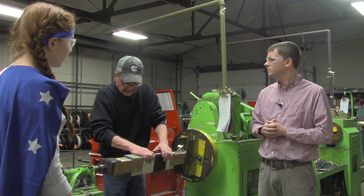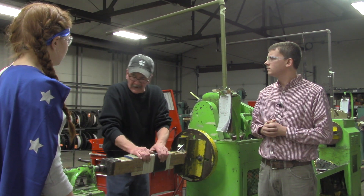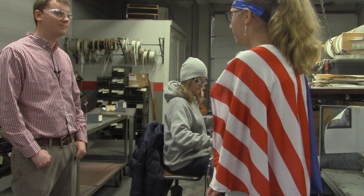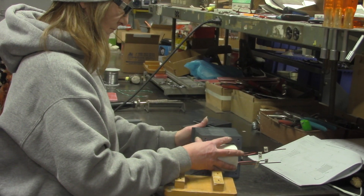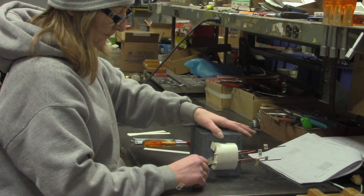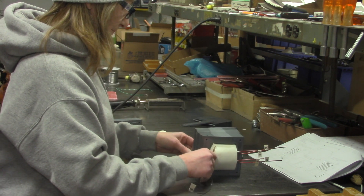I have an amount of turns, and I'll insulate that to go to a primary wire, which is a lot smaller wire. So I see the core that we made earlier — what exactly are you doing to it? Right now we're putting the core steel in. It's a magnetized steel that allows, when the transformer is energized, for current to run through it, so that way the coil does not get saturated.